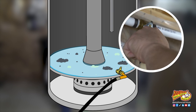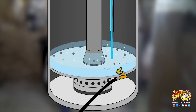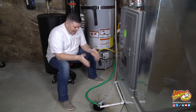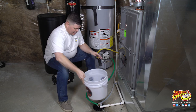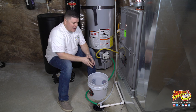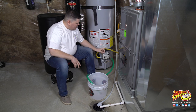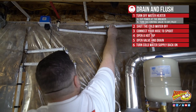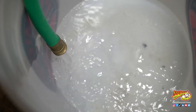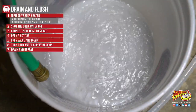After the water is pretty much finished coming out, we're going to turn the cold water back on. Inside the water heater there's a tube that directs the water downward, and the force of that water will help agitate and break up any stubborn sediment on the bottom — this helps ensure we get as much sediment out as possible. At this point, grab a bucket so you can see what comes out next. With all the water drained, the only thing left at the bottom is the sediment. Put the hose in the bucket, and while the valve is still open, turn the cold water supply back on. Run it for about 20 or 30 seconds or until you see water coming out of the hose again. Once you see water coming out, count to 10 and then shut the water back off. Repeat that process until you're seeing clean water.